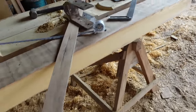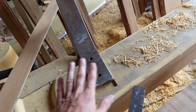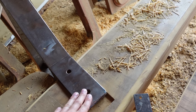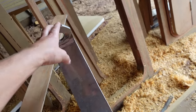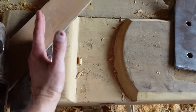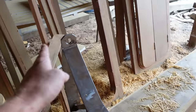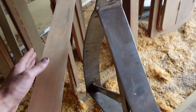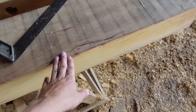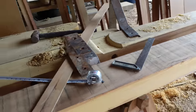Now over here, what was the dilemma? This thing, we want it to be close to the water, just above the waterline, so that it fits under the platform, but also we wanted the cables going from here into the transom not to be under the waterline. So if you look at this, this is perpendicular, and this is slightly at an angle, so it's above the waterline. This is the waterline, remember, but not in it, and this is pointing upwards over here, where it's going to enter the transom, which is far away from the waterline. That's the plan, and that's what we were measuring now.